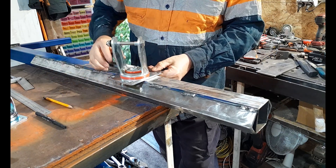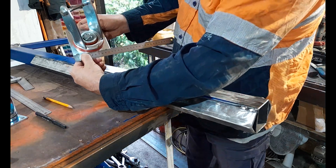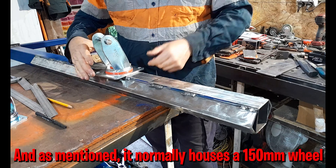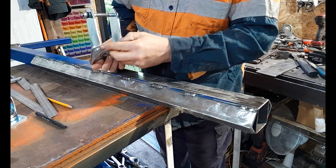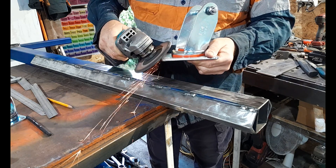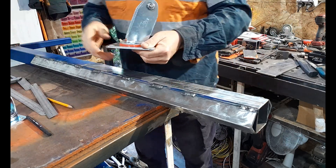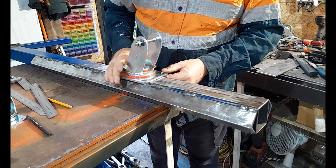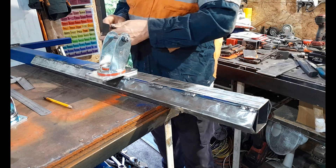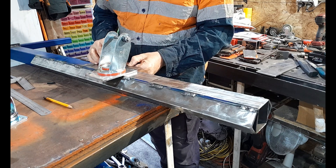The dimensions for the top plate of this caster: it's 110 millimeters in width and 135 millimeters in length — that gives you an idea of what you're going to try and track down. We're going to remove the zinc from both sides, and do that first before you mark or you'll lose your mark. Set this up right on our 300 millimeter mark. I've already cleaned my bottom plate ready to weld. Get the halfway mark of the caster in its width — 110 divided by two is 55 millimeters.